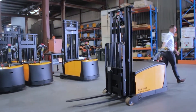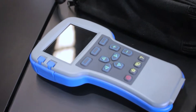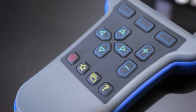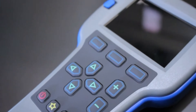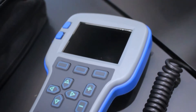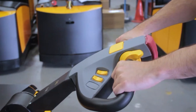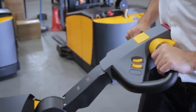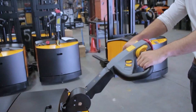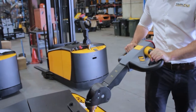The Task BOA legless stacker utilizes the state-of-the-art American-designed Curtis controller. Authorized Task technicians can adjust numerous Curtis parameters, including reducing the top speed of the unit, decreasing braking distance to complete stop, and adjusting acceleration time to reach top speed. The emergency reverse button is a built-in safety feature on all Task Forklift stackers, designed to reverse the direction of the truck when activated to help prevent operator injuries.